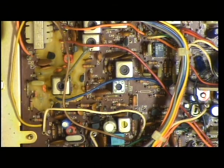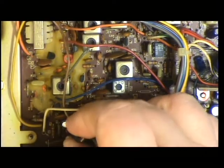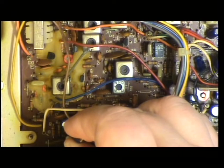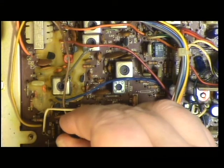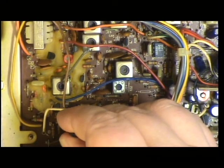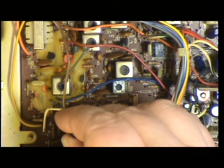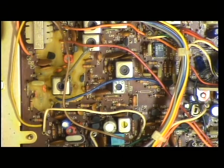We're reading 27.7919, so it's quite a bit out. The crystals drop naturally with age, but for some reason this one doesn't want to come down. So I'll just see if there's some modification left over - if not we'll just change the crystal.